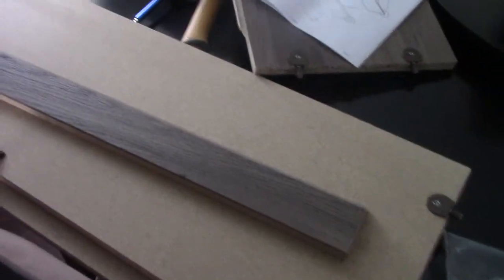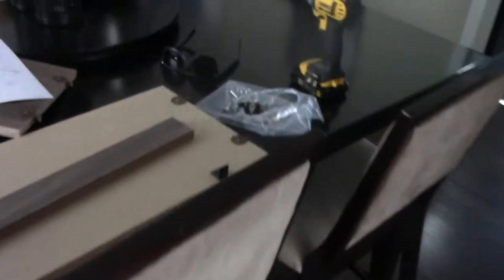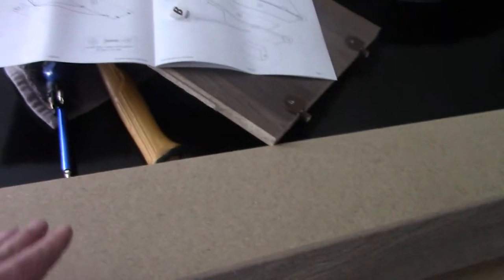You do not want to tack these little nails and try to hit the shelf perfectly, because if you miss, you'll chip it. Once you put the shelves on it's very simple — there's a little lip on these shelves and it just slides right on, you can't screw it up. Hand tighten these, do not use a gun. Then use a hammer if you need to — put a towel over it so you don't chip it, just to get everything in place. Very nice finish, I like it.